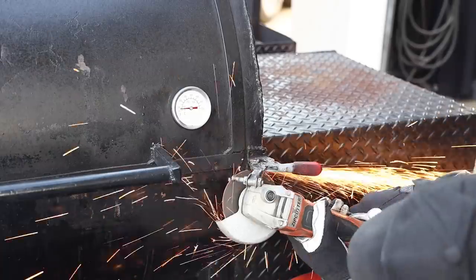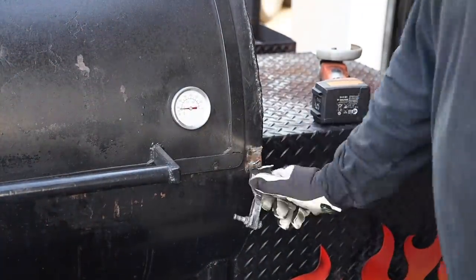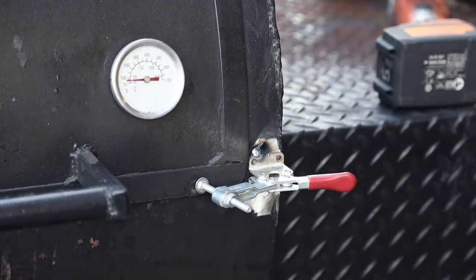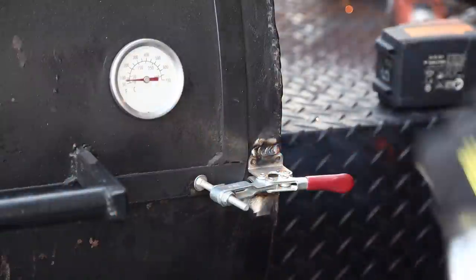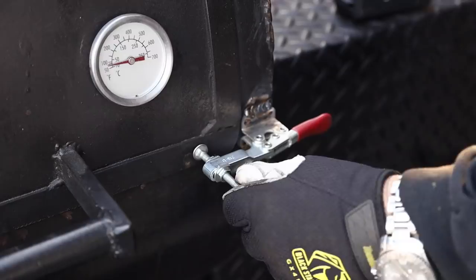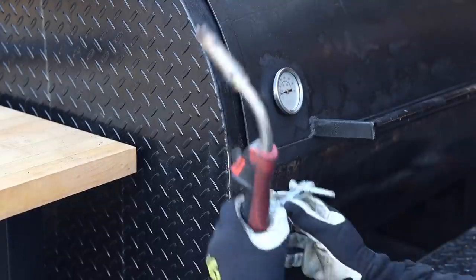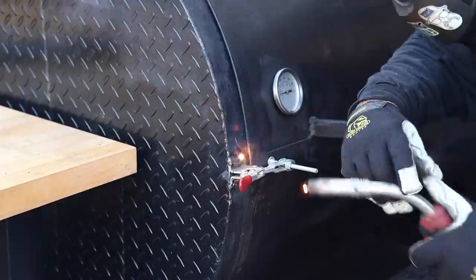The next thing is to replace the clamps on either side of the door. On one side there was just one clamp, so we're going to add another one. The clamp was worn out and not working properly. They were complaining that with only one clamp it left a gap and smoke was getting out — they wanted a tighter seal and asked if I could add a secondary clamp to the other side. Once I got everything welded, adjusted, and cut the bolt off and cleaned up the edges, repeated the same thing on the other side. That sealed the lid nice and tight.